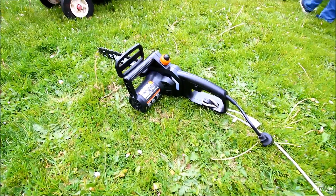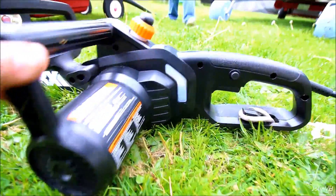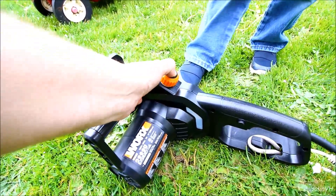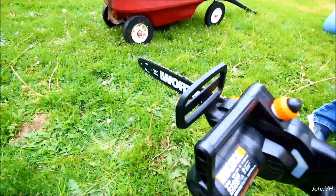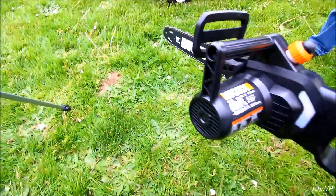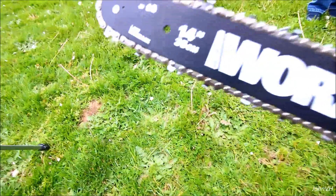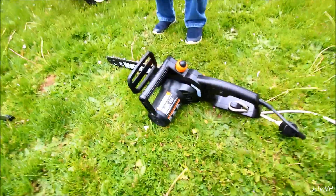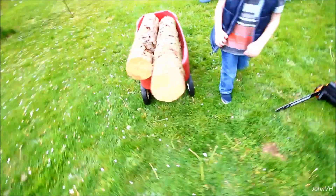We got some bar oil in it and I got it hooked up. I did one trigger press just to make sure it works, and you can see the bar oil in the window. It says to do one press for each cut. I pushed it a few times just to see some oil coming out, but so far haven't seen much. After enough presses, I am getting a little bit of oil on the bar — some little specks here and there. There's a big blob on there now, so it's finally coming out. Just takes a little while to get through the system. I've got a couple little logs here and we'll do some cuts.